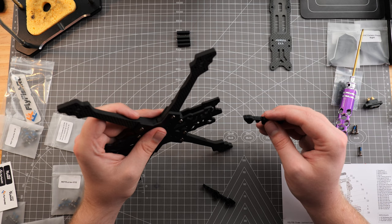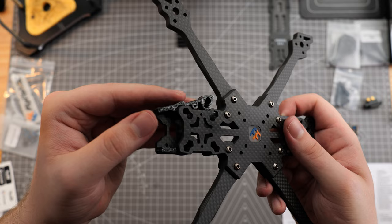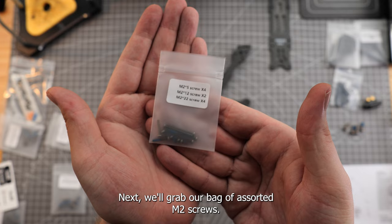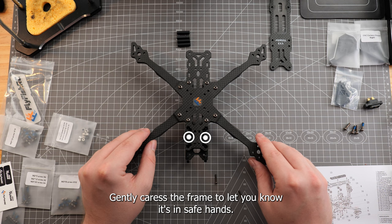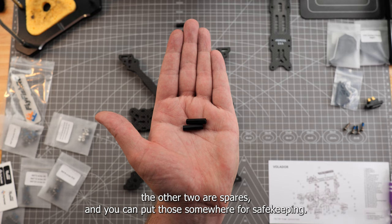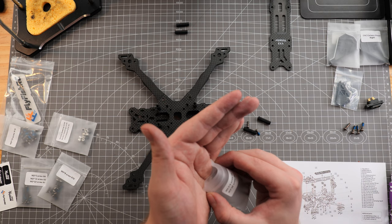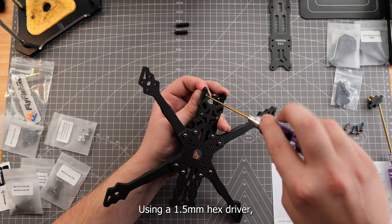Let's grab our antenna prints and squash those in between the bottom plate and the middle plate. Next, we'll grab our bag of assorted M2 screws — we only need the 12mm M2 screws for now, so go ahead and fish those out. Gently secure the frame, then ram that 12mm screw through the bottom. We'll grab two of the 20mm standoffs. Find the bag with the M2.5 9mm screws and take two of those out. Put both screws through the bottom side of the middle plate next to the antenna prints, then flip the frame over and tighten the 20mm standoffs onto those screws using a 1.5mm hex driver.